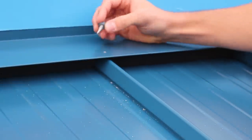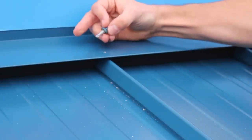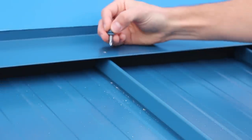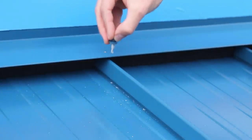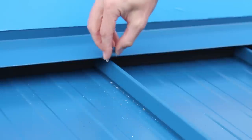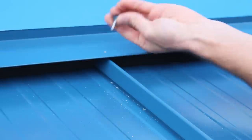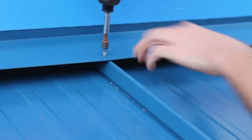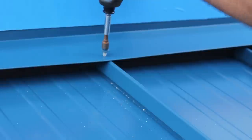All right, I picked a drill bit that would create a hole large enough for the self-tapping tip to pass through completely. And that's because, again, if I tried to use this self-tapping tip to get through the metal, it would get through the first layer, maybe the second one, but then that last one, it's gonna bottom out against, and it will have already bit in with the threads on the top layers, and it's just gonna push everything out of whack. So I've got this to a point where this will pass right through, and I'm just gonna put a huge amount of pressure down to keep this down where I want it, so that when the threads engage, they're engaging the right spot. I'm actually gonna get up here, just put all my weight on it.